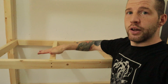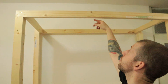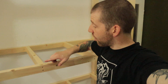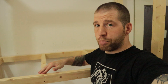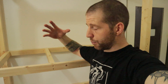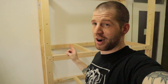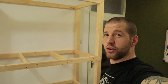This will secure the setups even more and also give a bit more sturdiness to the top. The top isn't braced because there's going to be a complete shelf on here so I can put stuff on there. What's really important to think about when you're putting these braces in is that they are at least flush with the beam that's going to carry your setup or aquarium — or maybe half a millimeter to a millimeter lower — to prevent any part sticking out and poking into your glass. Because if you have a sheet of glass that's 120 x 60 with all that weight on top for decoration or water, and there's a small thing poking into that glass, the glass is bending over it and on the long term things can happen, especially if you move around. So really think about that. Make sure this is flush. Super pleased with the result — let's get going with the other one.